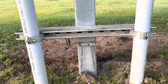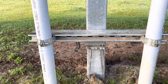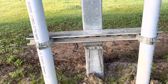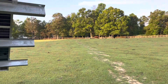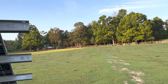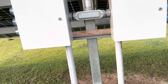I have three bare number six copper wires tied to this ground bridge. The one to the left — you see the little loop I left in there in case I wanted to extend it for something else later. That one is in the same ditch with my PV circuit wires that go underground back over to my solar power building, which is right up over there — that's about 425 feet. That bare copper is buried in the ground, and that's another way of developing a grounding system.